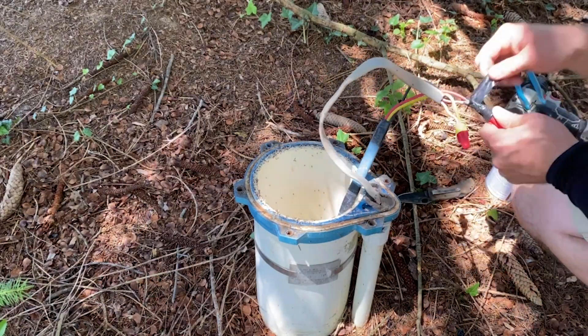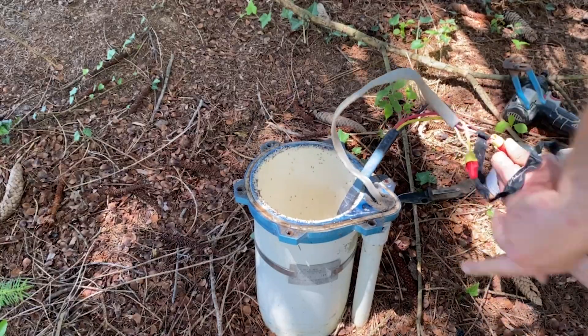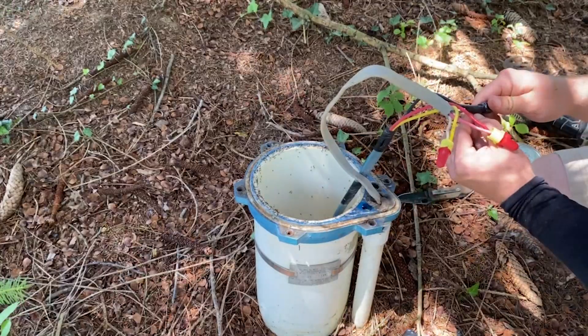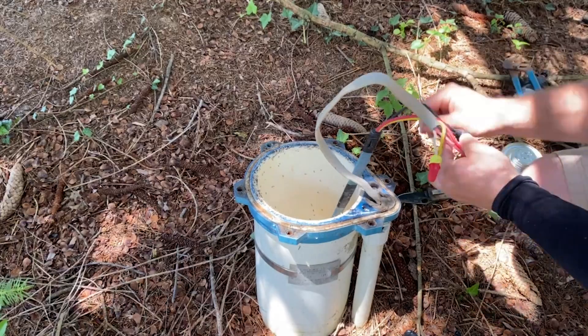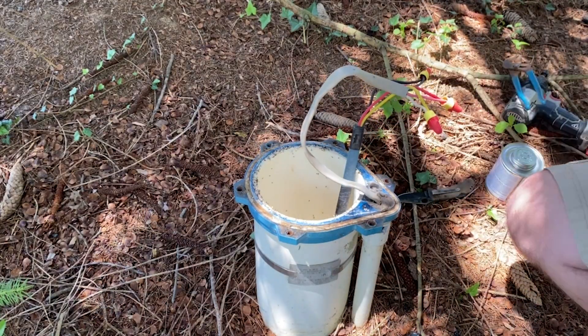What I'm doing right now is double-checking to make sure the power is off, and then I'm disconnecting my wires. The reason I have to do this is because the electrical wire goes up through that conduit, so it's very important to disconnect it so we can fix the broken part. After I get all of the electrical tape off, it's very important to double-check one more time for power.